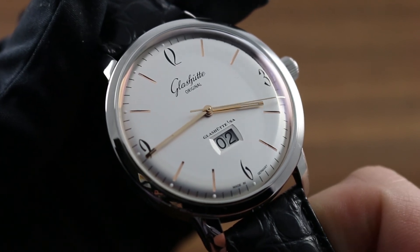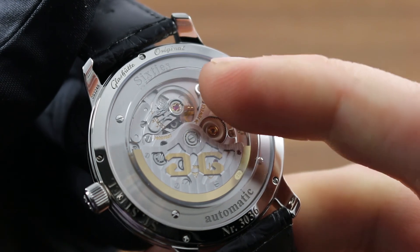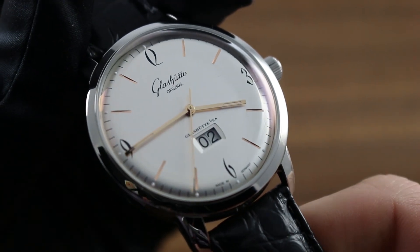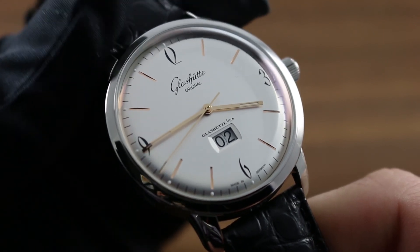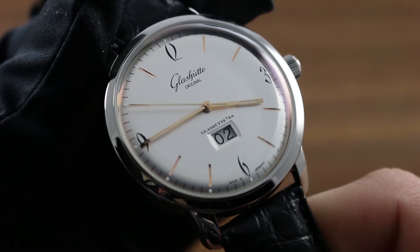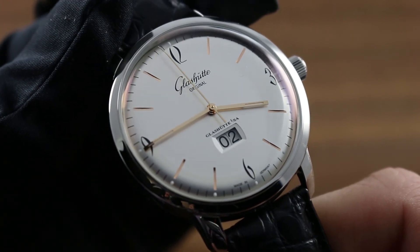Magnets are not only ubiquitous, but they are the silent killer of a watch's precision. The ferrous hairspring at the center of your watch's balance — effectively the heart of your watch — can become magnetized. This can happen because magnets are found everywhere: in the closures of wallets, purses, and refrigerators, in speakers and subwoofers, as well as magnetic resonance imaging equipment. A magnetized hairspring will cause erratic running — it may run very fast, very slow, or alternate between the two. If you suspect your watch has become magnetized, take it to a Glashütte Original Service Center, where specialized equipment is available to quickly and easily demagnetize your watch.